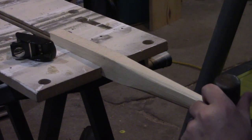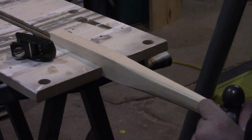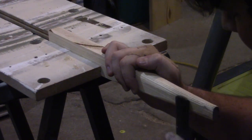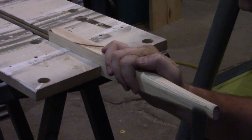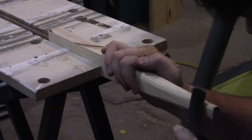Once I started getting closer to the size of the eye on the handle, I took the hammerhead and jammed it onto the handle. Wherever the head left marks on the handle, I planed it down further. Eventually I remembered that I had a set of files, so I used those as well to finesse the fit at the base of the hammerhead, since the top of the handle was clearly fitting through the eye as-is.